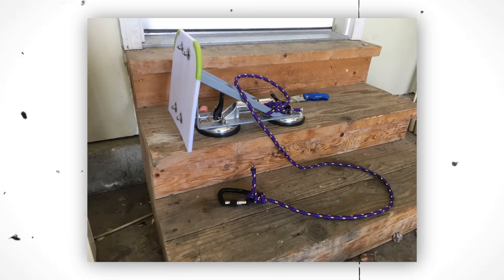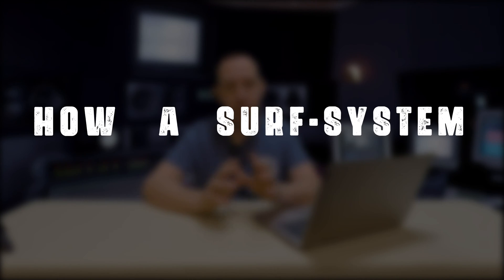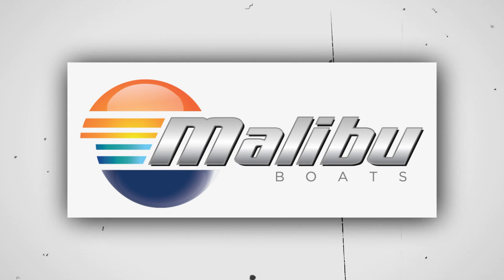The suck gate uses a glass suction cup with some sort of board attached — in this example, metal brackets and a cutting board bolted on. Before getting into it, let's understand how a surf system works. The first company to discover a surf system without listing your boat was Malibu, and they largely discovered it by accident. They weren't using fluid dynamic computer simulations — they accidentally found that if you shoved something in the water, it made the wave go around. As I understand it, they used a paddle and shoved it in the water to direct water away from the boat and saw that the wave got better. Then they started playing with different designs until they came up with the very first surf system.